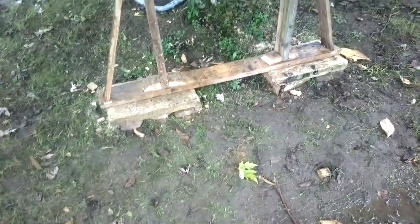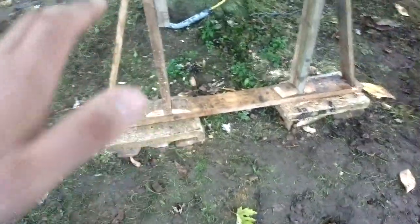And here the same — everything is just connected. If you look like this, everything is connected like one piece. It's really strong, really tough. I put a couple of blocks because wood and dirt — wood rots much faster. I could make just a simple detail that goes directly to the ground, maybe this would be simpler, but in this way it will last much longer. Plus here the water level is just reaching really high, so for this reason it's not convenient to do it like that. For this reason I just put a couple of blocks.